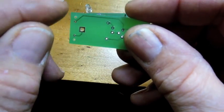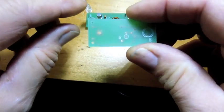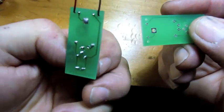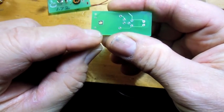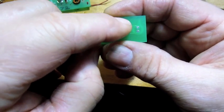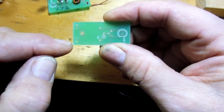On your board you have two holes without any solder pad. Your wires go from the top side where the graphics are, down through, then turn 180 degrees and plug into the two solder pads. I use red and black — red for positive. The red wire goes right here where the track goes over to the big hole — that's positive. The black goes to this one that goes over and hooks to the emitter on your transistor.